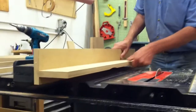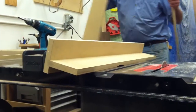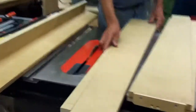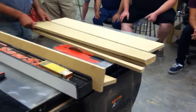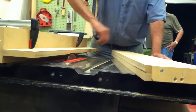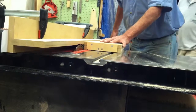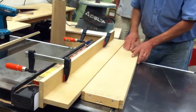This fence clamps on here, and I'll put this back in the jig and show you. Remember, this was a piece that was 7½. So you're cutting this piece off. I'm doing a dry run, perfectly in line with this blade. What you're doing is this pattern is riding against this fence — it's called an overshot fence or a pattern fence. It rides like this and it's going to cut to what this pattern is, so the pattern better be right, and you just go on through like that.